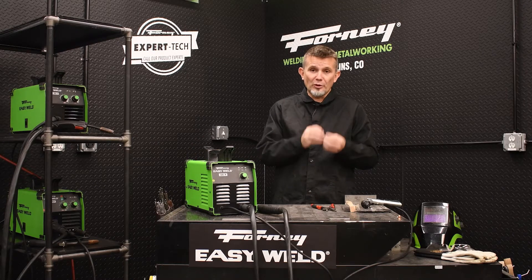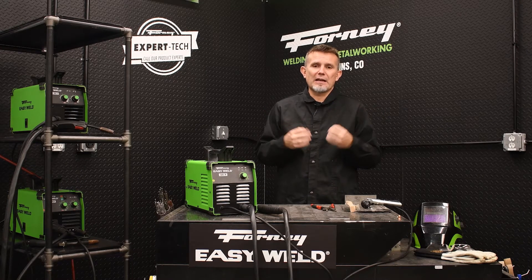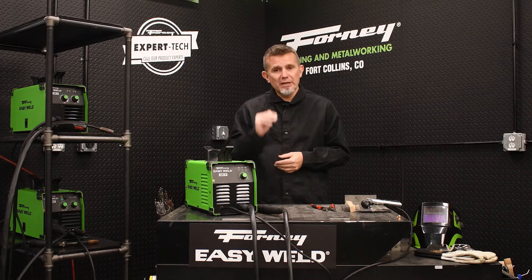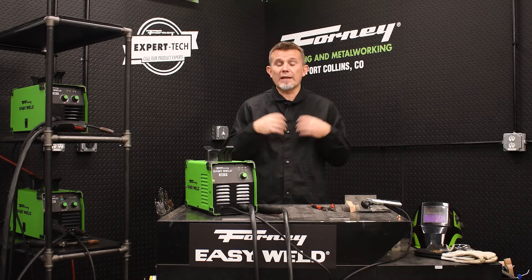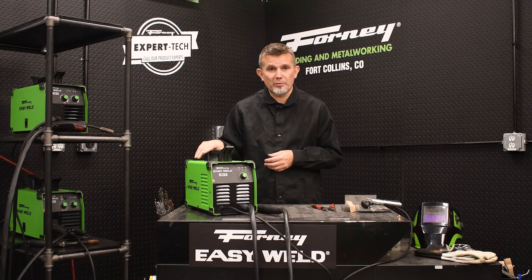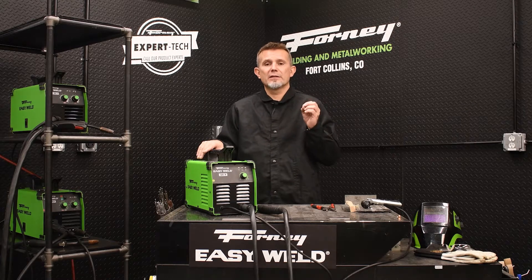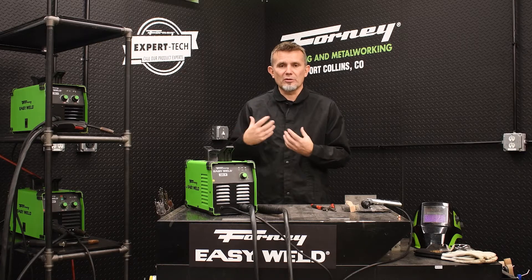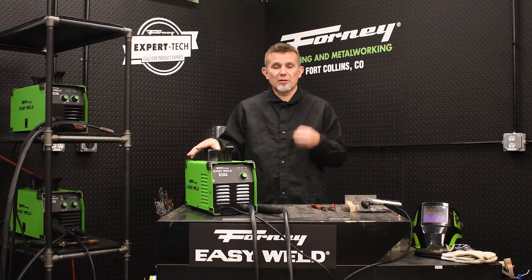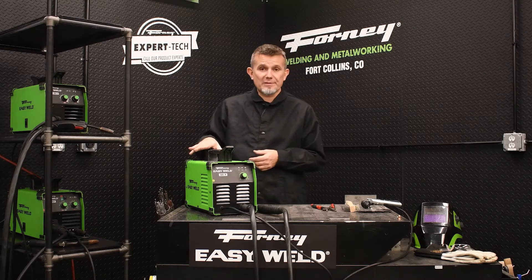Along with the input voltage, I need a dedicated outlet. What I mean by a dedicated outlet — I don't want to have lights hooked up to my outlet or running off the same power. I need a full minimum 20 amps of input power, so you need a 20-amp circuit breaker minimum. However, occasionally you might trip a 20-amp circuit breaker, so we highly recommend you explore getting a 25- or 30-amp dedicated circuit breaker. Some of your electrical codes — you need to consult with your local electrician — but a lot of your electrical codes will actually allow you to jump up to a 25- to 30-amp circuit breaker, and you can increase the wire gauge size. But it has to be dedicated, and it's only for welding and plasma cutting.